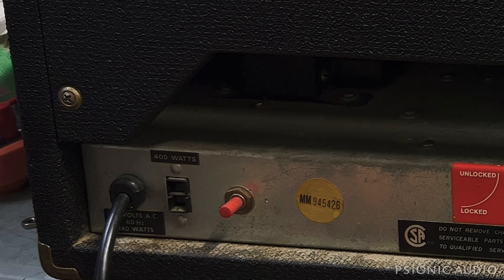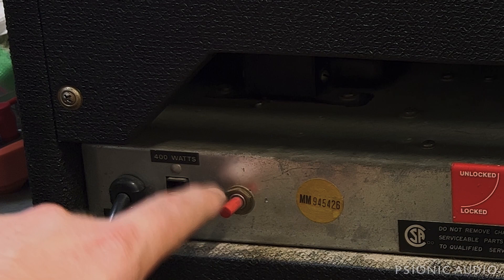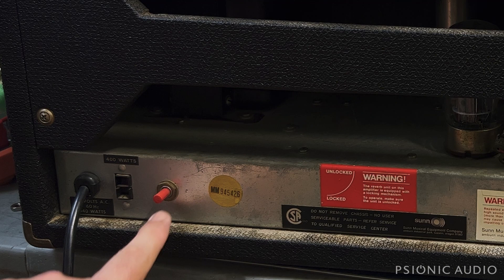Circuit breakers will often protect against a dead short, but won't protect against an overcurrent situation. By the time you realize there's a dead short, something burned which caused that dead short. A fuse could say, hey, the operating current has gone up — let me shut that down before something burns, before something creates a dead short. The other problem with circuit breakers is they have a finite lifespan. Once they are past their prime, because they are mechanical, they no longer do anything at all. I would not be surprised if this one is defective, but it certainly should be changed out for an actual fuse.